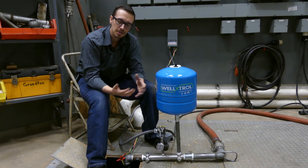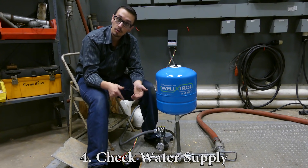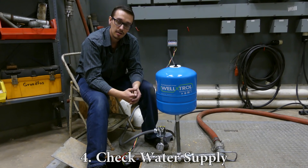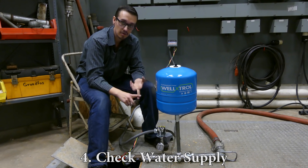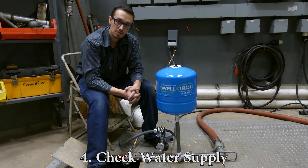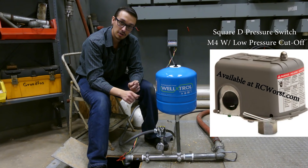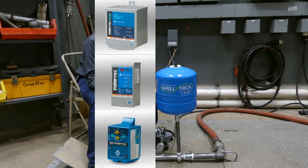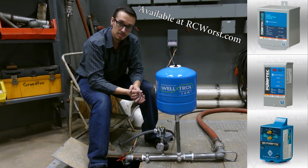The next thing that could be occurring is potential low water in the well. If your pump is just running but not delivering any water, that could be a good indication there's no water down there — this usually happens in drier times of year. You don't want to run the pump dry because it's going to wear it out quickly, and the motor won't get sufficient cooling, breaking down the motor winding. They do make relatively inexpensive motor protection units for this — one version is a pressure switch with a low pressure cutoff arm, and there's also a more expensive electrical motor protection device. Feel free to give us a call and we're happy to walk you through selecting the appropriate motor protection unit.